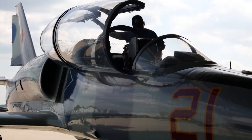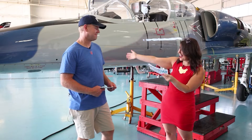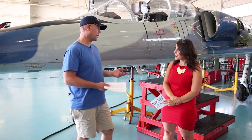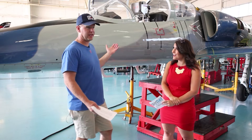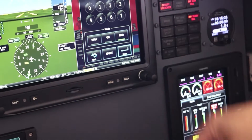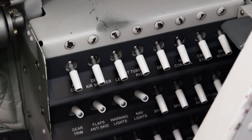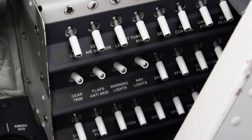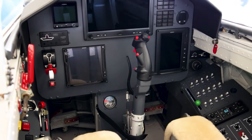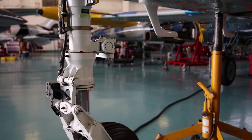The ultimate goal, of course, is to get the aircraft back in the sky flying. After a major restoration, you can imagine how important it is to make sure all the systems work once we get in the air, because we don't have a lot of options up there. So we have to check the hydraulic system, the gear has to go up and down, the brakes have to function properly, and the electrical system — a lot of which was modified — requires us to check every single switch, every display, all the actuators, all the flight controls. Everything needs to be function-checked in the hangar.